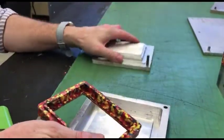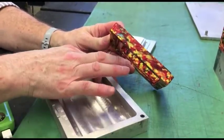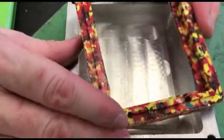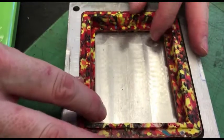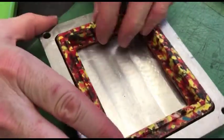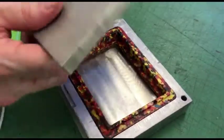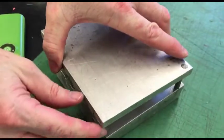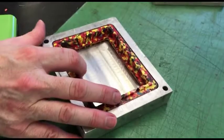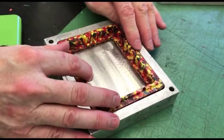This is the mold for this one, and it's kind of hard to tell, but this was machined with about one degree of taper, so it's got some draft. This is set up so that one of the things we wanted to do is have plenty of plastic in here, and then this would force it out to the edges.